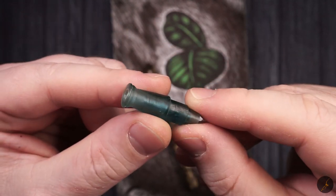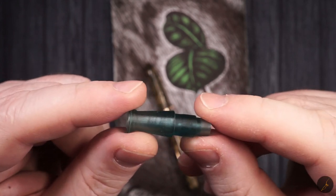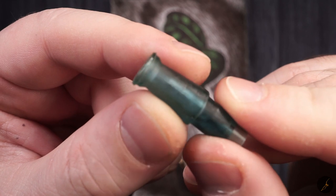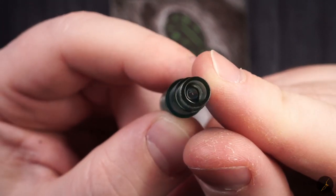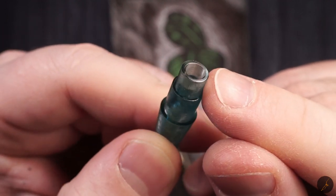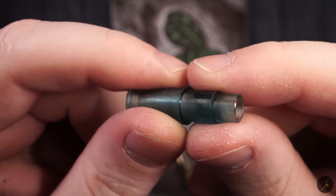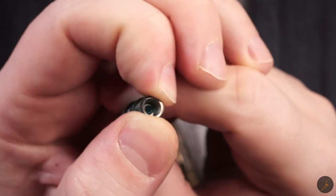Definitely one of the things I have to watch for is not printing directly onto the bed. Most probably I'll have to print at an angle. It's quite funny. This part mushroomed at the end, and I have no idea why. But the other end actually turned out very well, very sharp. And this gives me a lot of hope. It's just a matter of experimenting with it. And I think with a little bit of sanding down and polishing, this could actually look pretty good. And it's strong as well.